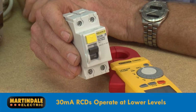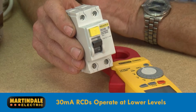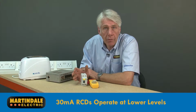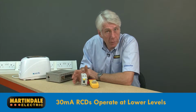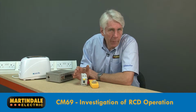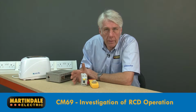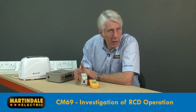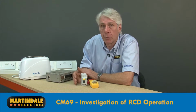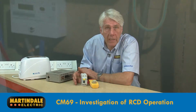30 mA RCDs providing additional protection against electric shock can actually operate at much lower levels, even as low as 22 milliamps. So with typical currents of 1.5 to 3 milliamps for some equipment, it is possible for these to add up and cause the RCD to trip. Sometimes as well, appliances may start to produce higher currents, perhaps due to components starting to fail. In residential applications, often a quick chat with the occupier will help to identify a pattern and highlight which appliance may be the possible culprit. But in many cases, it may be more complex with several sources of leakage current.